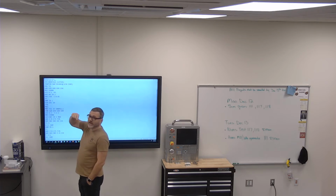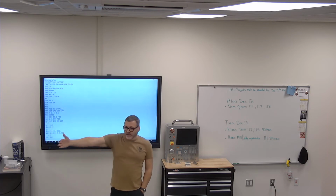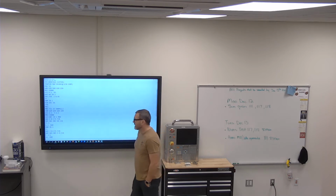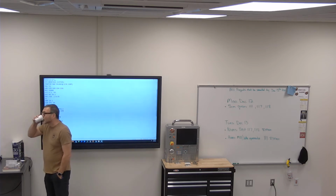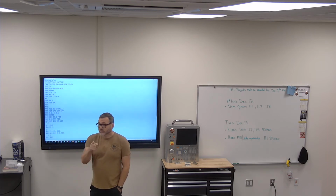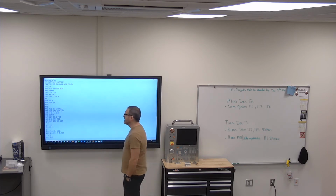What is this F50 on there? Feed rate. And how is the feed rate measured? Is it measured in yards per year? Percent, inches per hour, inches per minute. Yep. So feed rate for the mill is primarily indicated by inches per minute. Now the lathe is different. It's inches per what? Inches per revolution. So IPM and IPR.